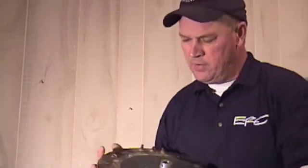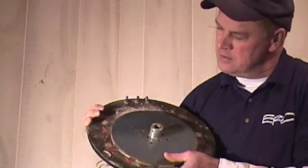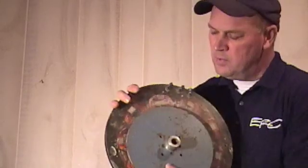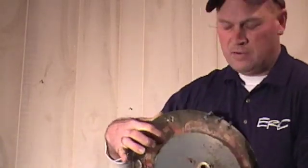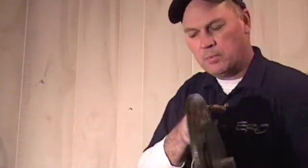They're quiet. They're fun to watch. We're having a good time. What I want to show you is what's different about our alternator. This is the classic sort of Hugh Piggott design axial flux permanent magnet alternator. This one happens to be WindGen Kits, and this is a great alternator. You can see the big coils in here — there's nine of them. Two magnet plates.